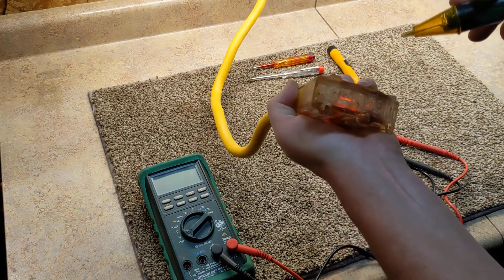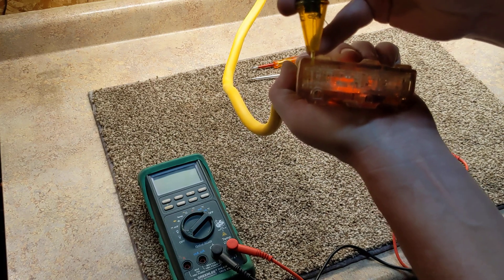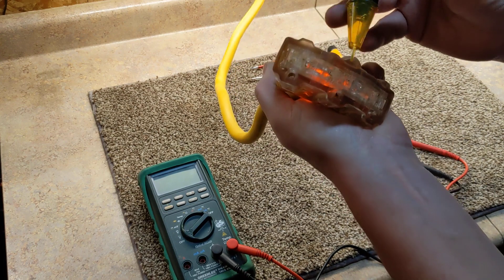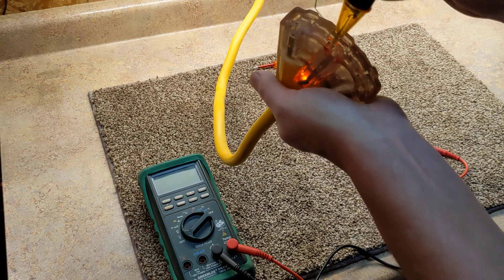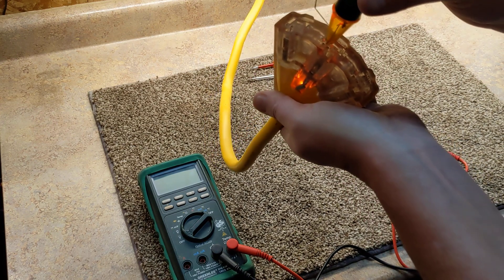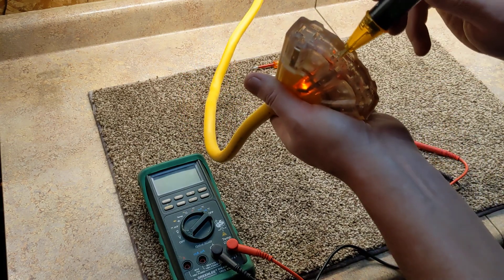Here's an example. If I hold it this way — your left prong is your neutral, the right is your hot, so left neutral, right hot. Because they're close together, if I go on the far outside neutral it reads cold, but if I go on the neutral which is cold, look — it's reading power, because I've got a hot wire on either side and I'm too close.